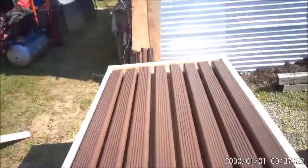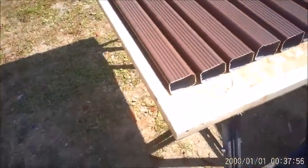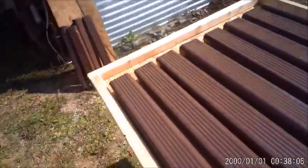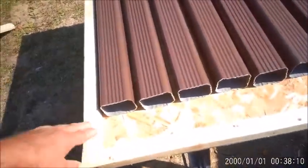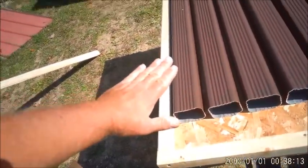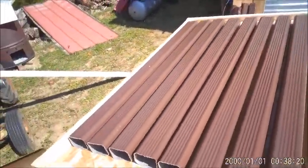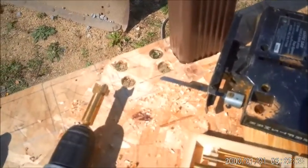I'm going by the glass that I have, so there's no sense giving you dimensions because yours will be different. My glass will fit in here with a little bit of space left over, on the inside of that lip, but I need to make it a little higher and put some baffles in there. I'm using a Forstner bit to cut the corner radii and then a jigsaw to cut out the middle — you can see it fits pretty good. We're going to have eight of these all along here.